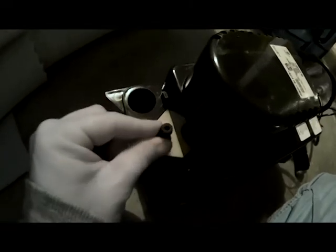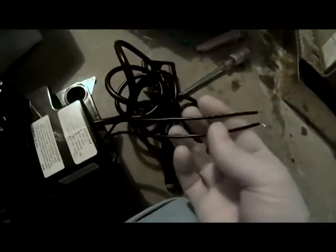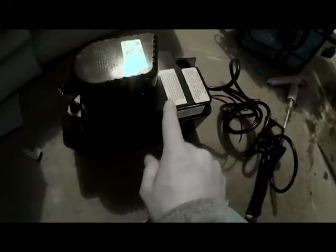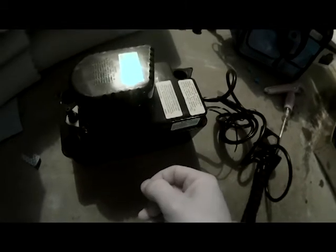This is the pump that we're going to replace it with. It's pretty much exactly like the pump we're taking off — it's got three openings in the top that you can put your drains in, this is where we hook up our vinyl tubing to pump the water outside, and right here you've got your float safety switch, and here is where your power plugs into the receptacle. Always when you do a condensate pump, notice it's got a little piece of cardboard — you've got to remove that piece of cardboard out of the condensate pump. It kind of holds the float switch in place during shipping, so you always have to pull that out to make it operate.